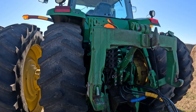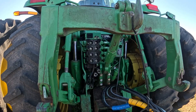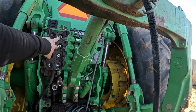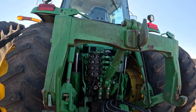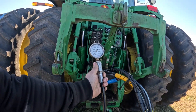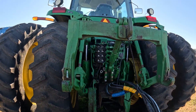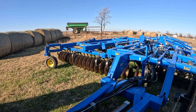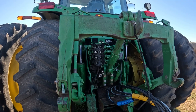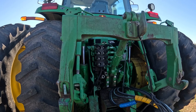We got this 8520 that we're working on. I did a green light inspection on this tractor and found that two of the couplers — three and four retract — were both leaking down. When I tested them with a set of pressure gauges, I'll show you how to test that. If they're leaking down, usually they'll either leak externally, or if you have an implement, the implement will settle because the coupler itself or the o-rings are causing an internal leak.